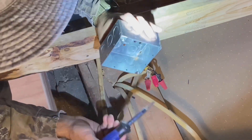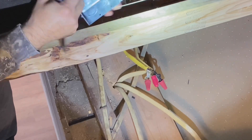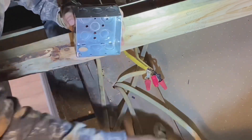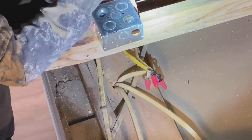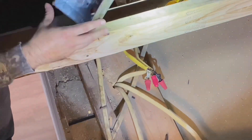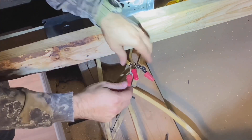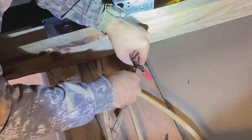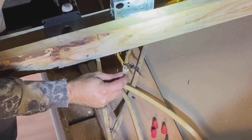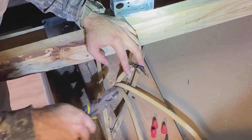What you do is you take a screwdriver and some pliers. Now I'm going to take these wires out of their wire nuts. We've already checked to see if the wire is hot and it's not. Taking a pair of pliers — these should be twisted together, which means they did it right. But now you've got to untwist them.